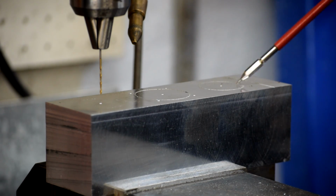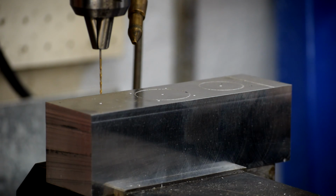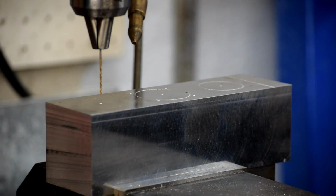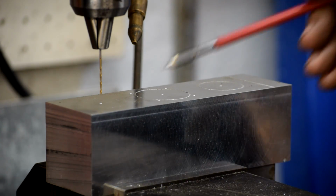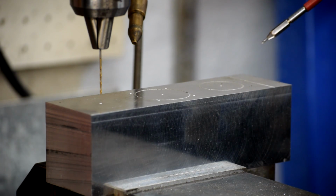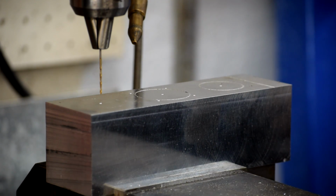These ones here are a little more defined. This here is the cut line for the saw once we're all done. The idea here is that the X-carve is very precise in its layout, so rather than doing all the work of layout with Dykem and then measuring with rulers and micrometers and scribers and hermaphrodite calipers and the rest, here we just plug it into the X-carve. It comes down, goes zap, zap, zap, carve, carve, carve, and now we've got our layout perfect.